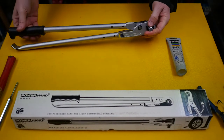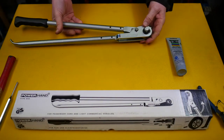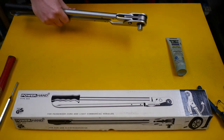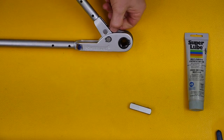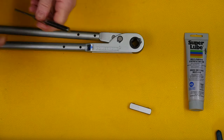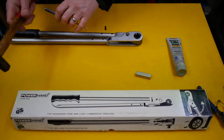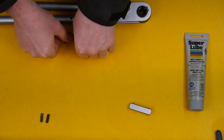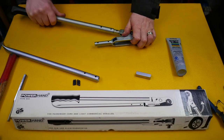Time to take a closer look at this Powerhand 650 in more detail. I will also take the opportunity to lubricate the ratchet and pawl while the tool is apart. The ratchet sounds quite echoey so I presume there's no grease in there — we will re-grease this. We'll take out the adapter, which is half inch. Note the position of the lever, because if you put that in back to front the ratchet will work the wrong way around. We need to take out four split roll pins so we can remove the reaction bar and the handle — those should then just slide off.